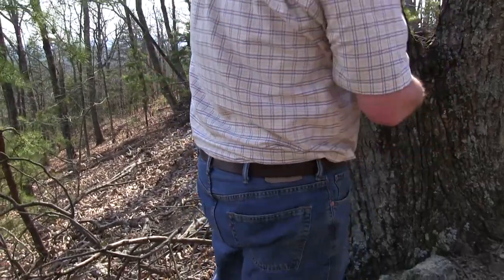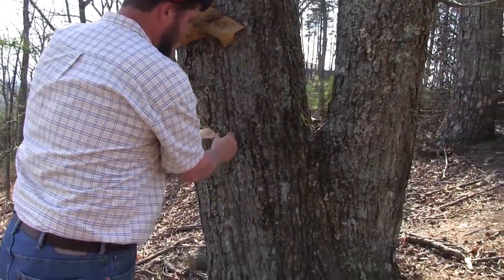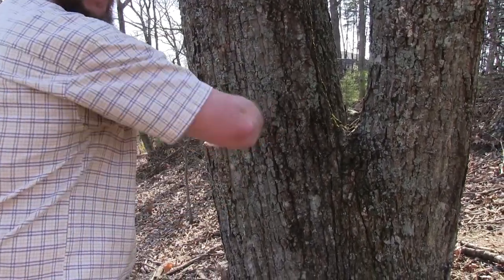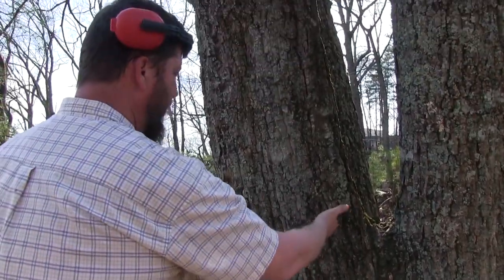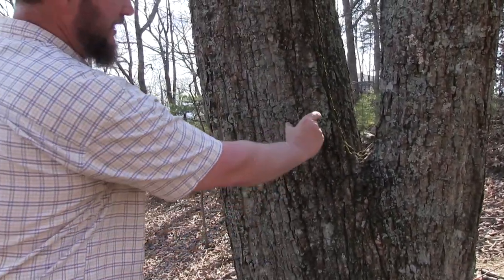What I'm going to do now is bore in from the side. I'm going to leave my hinge about an inch wide in the front of it — right here. That will keep that tree from sitting down until I get all the middle cut out of it. I'll go from this side and I'll go from that side, and I'll leave about that much meat in the back holding.